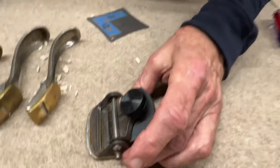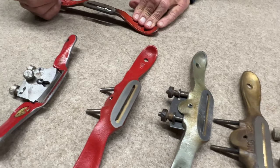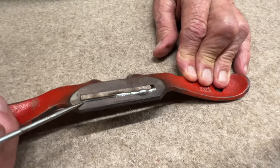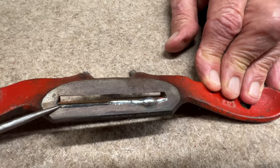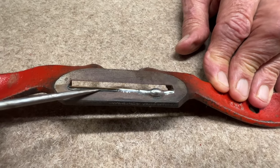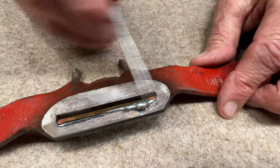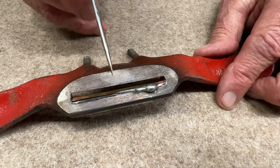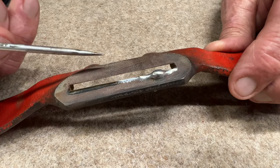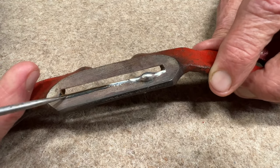The solder works great, the method is great, and we suspect that the problem with this part was that there's some kind of inclusion or contaminant in the surface of this casting right over here that made it difficult for the flux and the solder to work together and wet out this part of the surface. So we'll find out a little bit more when we curve it today. We're going to put a transverse convex curve on this blade in both directions in order to get it to be the correct curved surface for working on archtop plates. And when we do that, we'll get down into this joint a little bit. We'll see a little bit more about what we have.